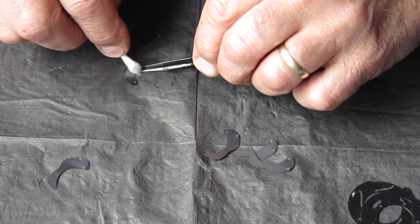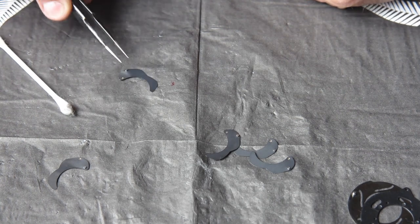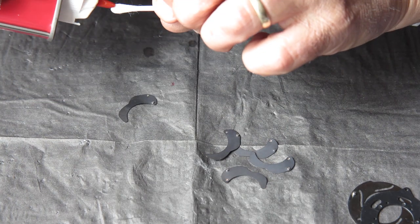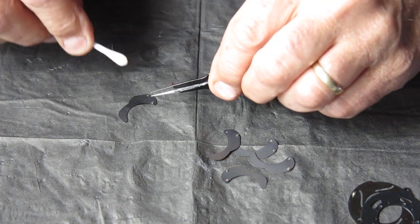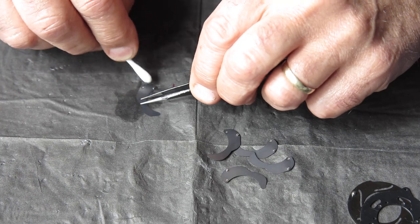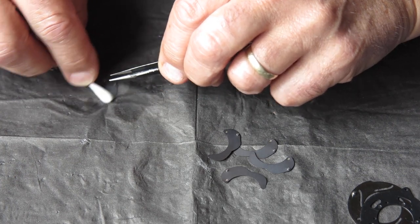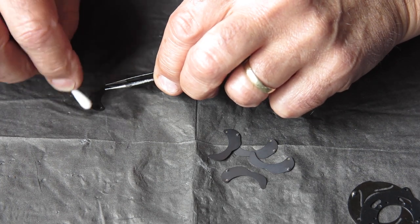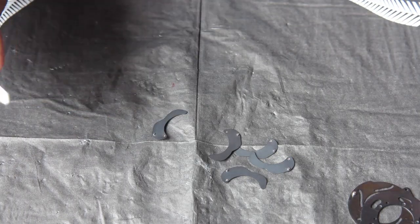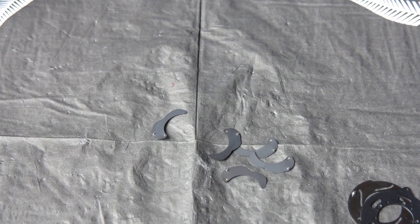The amount of oil on these blades - I would not have expected there to have been a problem with them in the camera. I think it's much more likely that they showed some obvious marks and the owner decided it would be a good idea to remove those marks, but I don't think the oil on the blades would have been sufficient to cause a problem on its own. Oil on the diaphragm blades can stick the blades together and cause exactly the sort of fault we saw in this case - but that was caused by solvent.